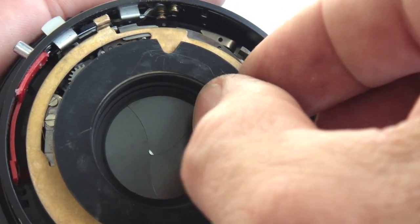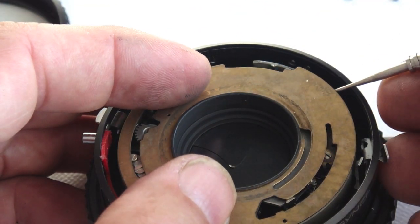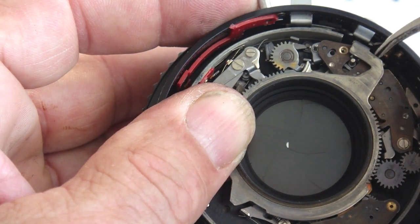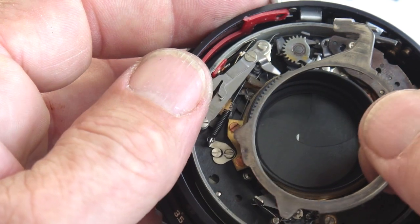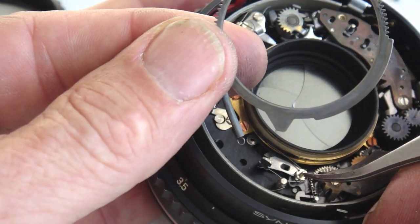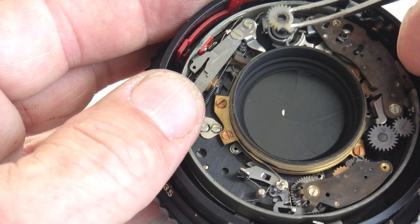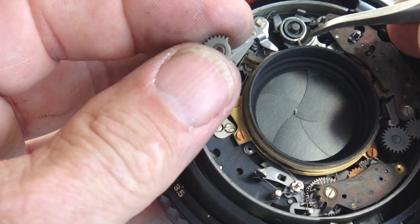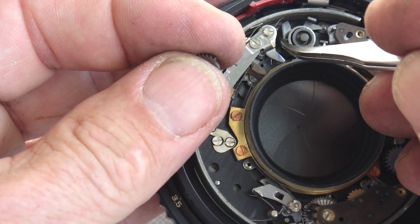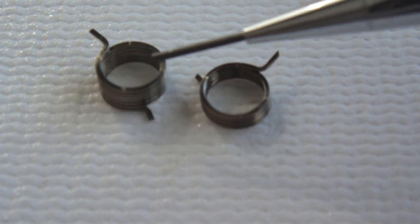Now remove the black mask ring. Use the tip of a flat screwdriver to pop the low tension spanner ring free and lift the shutter speed cam plate. Note the main wind gear in relation to the main wind rack. The main wind rack ring will lift free. Watch for the spring as it's attached to the post. Now lift the main wind gear off of the wind pinion so it won't fall out during the rest of the work. Note the main wind spring — you can see where it attaches at two points. There's a slot that the end of the wind spring sits in at each end. The main wind spring often breaks; you can see the different lengths of the leads on the spring.